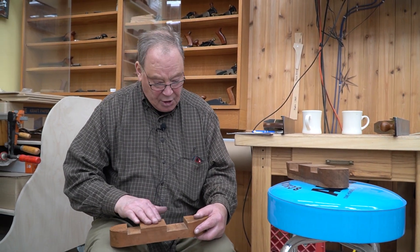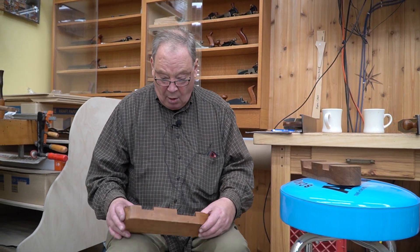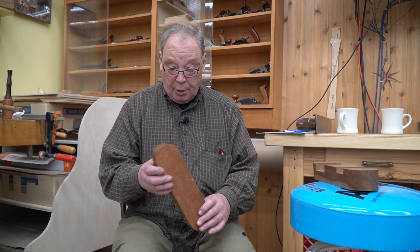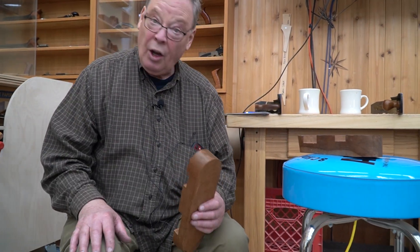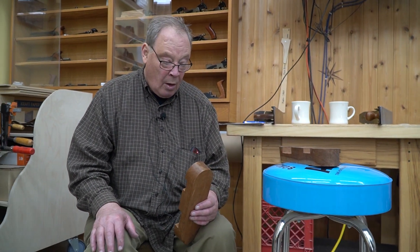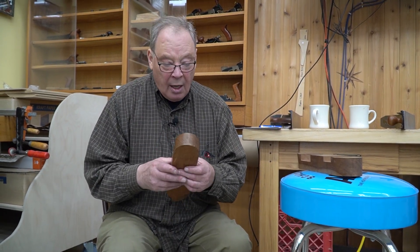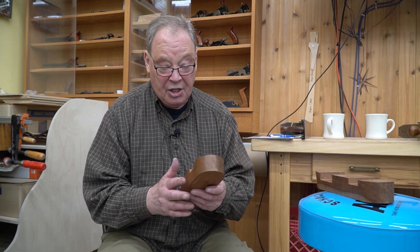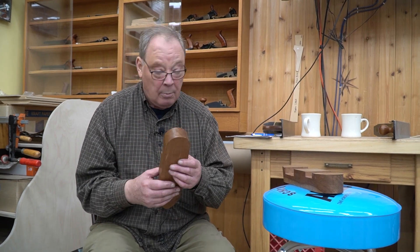It's not quite as good as the plane because this is all done with a chisel in the bottom. The stern of the boat is done with a spokeshave — another form of the plane. It's a self-guided tool, but this has to be 90 degrees at any point that we measure it. The difficult part is making this transition from flat to round be smooth and mechanically true.